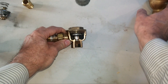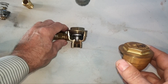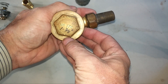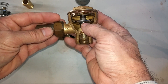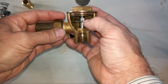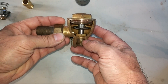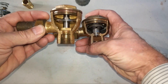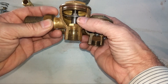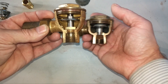The original version of this trap was probably designed sometime around the 1950s. This current version came out in the 1990s, I believe — if anybody knows differently, please leave a comment below. This is the earlier version of the Hoffman 17C, and they had a couple of designs of the thermostatic element. But even though they're both called the 17C, they're remarkably different in height, and you cannot install old Hoffman 17C elements into the new 17Cs. So this is essentially a different trap — they just call it a 17C.